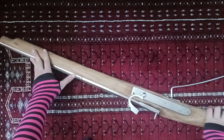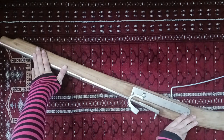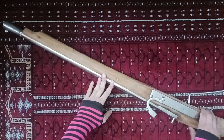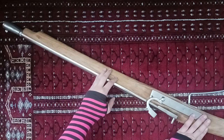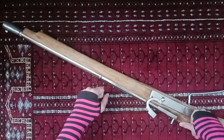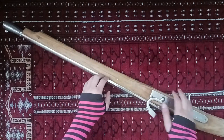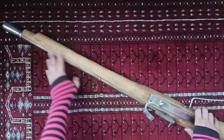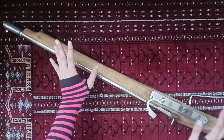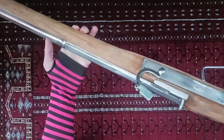I should mention this is not the way the wood looks when you originally get it. It originally comes with a dark brown, sort of lacquered, glossy finish, which I did not like. First of all, it doesn't look very historically accurate, and once it gets scratched, the scratches are very obvious. So I stripped it all off with a scraper and some sandpaper, and now it's just bare wood. What I will do soon is put linseed oil on it and give it a proper finish.